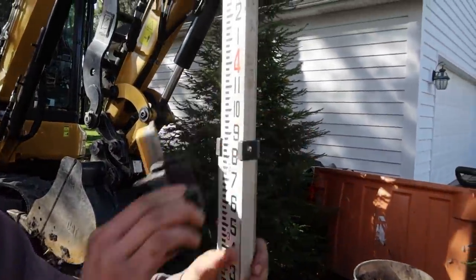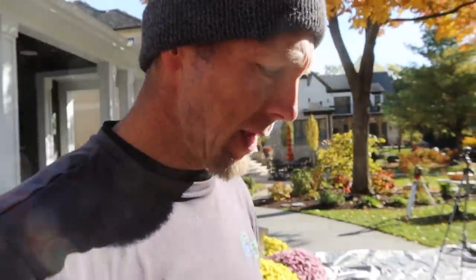There we go. So it's that easy. Hopefully that's a helpful tip or trick for some of you guys and gals out there that have struggled with keeping that stick straight up and down, and when you have to reestablish water level on a regular basis on a project. That way the skimmer, now that it's set, stays constant, so we just keep resetting water level to our transit stick regardless of where the rotary transit itself is sitting, at whatever height it's sitting, because that number will change on the stick.